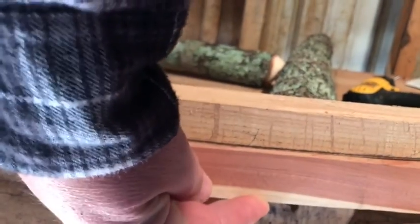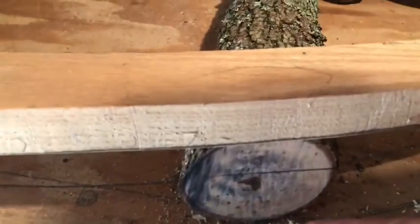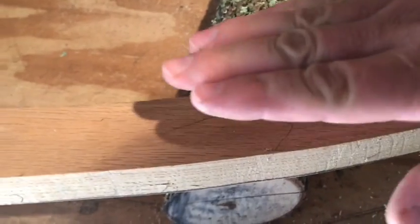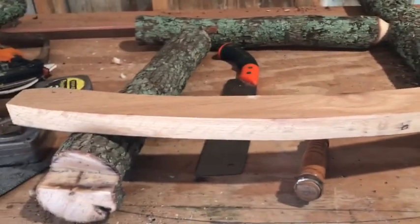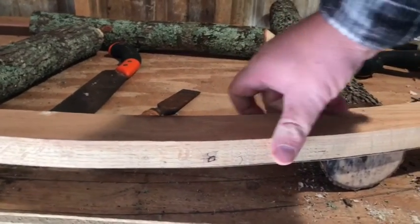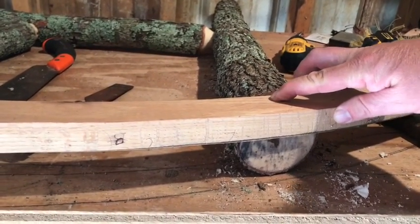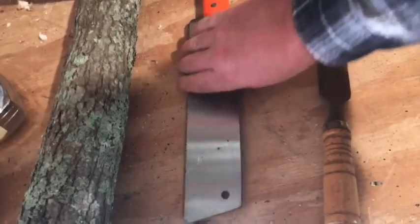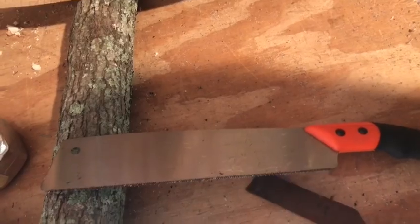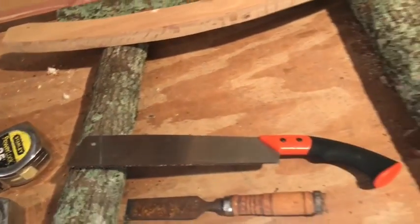What I've done is take a block of wood and put it right under that rocker so I could make a mark to know how deep I needed to cut this log. I've got the score mark across here, so I'll make those two points meet, cut across there and cut down through here so I can inlay this rocker down inside this log. You can see I've got this notched out on both logs. If you don't have a good bandsaw, you can use a hand saw — Harbor Freight has them for around three or four dollars — and a chisel to help notch this out. You don't have to have fancy tools, it just takes a little more effort.